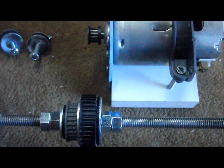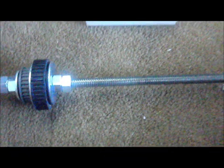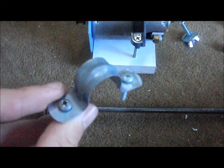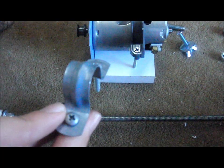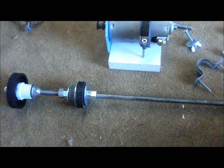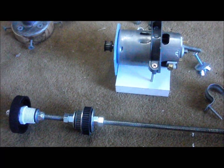All that's left to do is create the bearing stands, which I'm going to make out of wood. I found these pipe mounting plates that fit the bearing perfectly, and I'm going to use those to screw the bearing into the bearing stand. Then all I need to do is cut the threaded rod to the appropriate length, attach the chuck, and I'll have something that works.